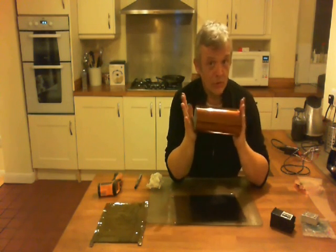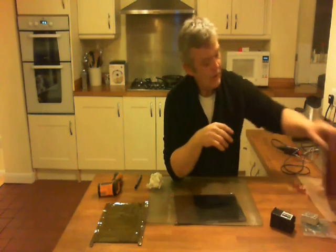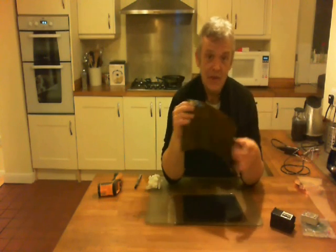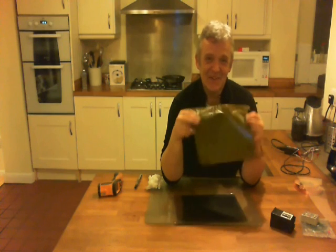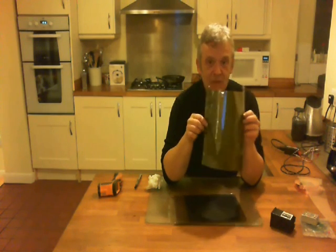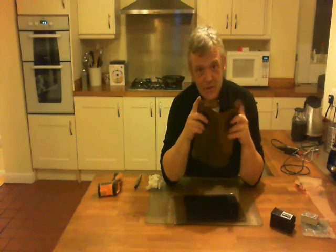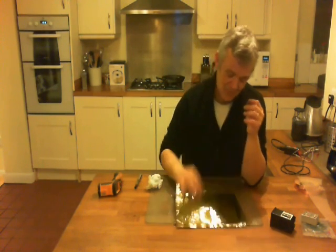Running it constantly at 200 degrees is going to be no real problem if Kapton is the base material. It's a bit difficult to manage the Kapton because it's so thin, but there is a Kapton tape flexible heating element here. Same thing — copper strip either side, then a graphene layer in between. You connect up the two tabs, put on a current, and that heats up at about the same rate.